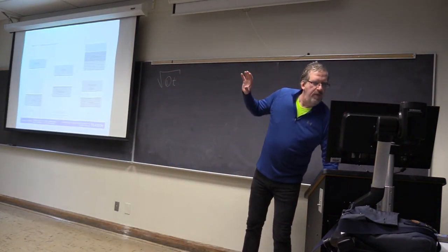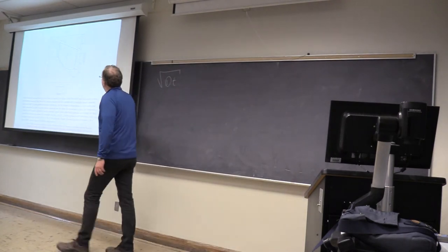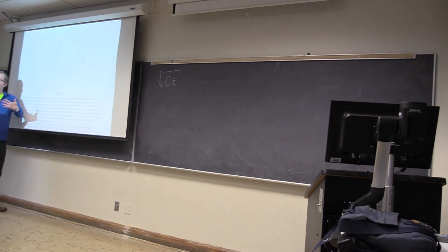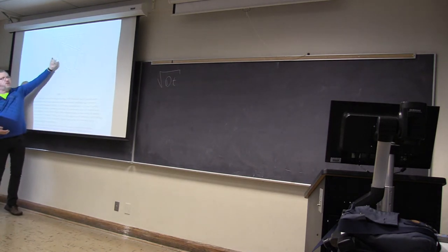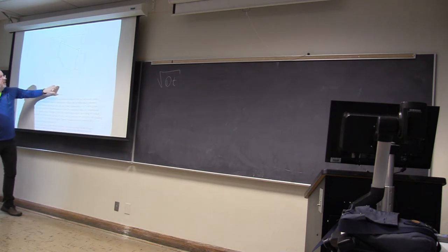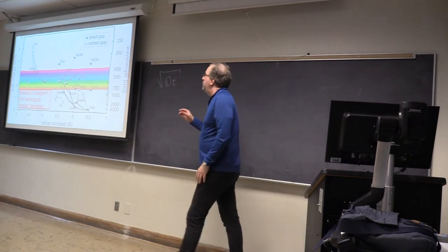So we have the forbidden band gap. Yeah, here's another version of it. And so then what I've always been trying to emphasize is that most of these are lying along this diagonal. So as the lattice constant gets shorter, the interaction gets bigger, and the splitting gets more dramatic, and the band gap blows up. So although Mother Nature will scatter data points, this is kind of linearly varying, inversely with lattice constant, the band gap. Right. So this is maybe more dramatic.